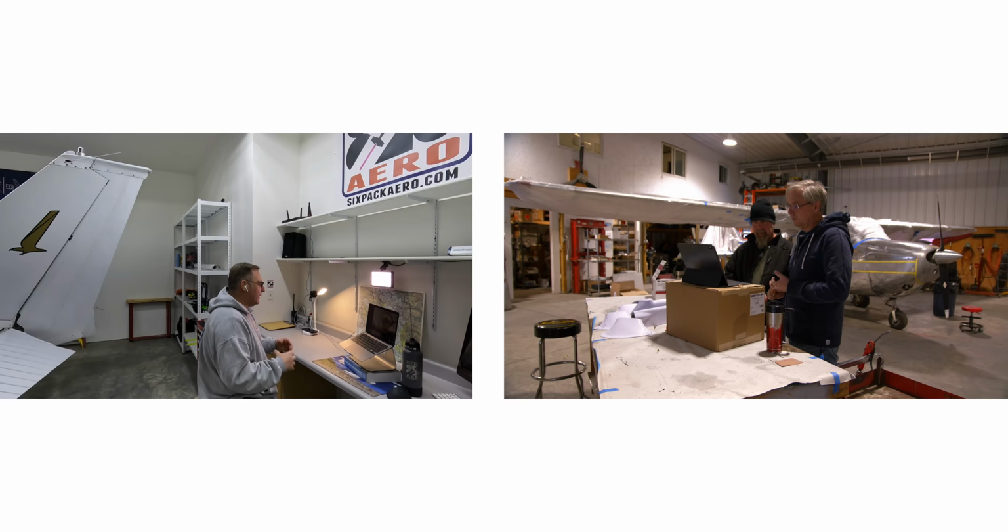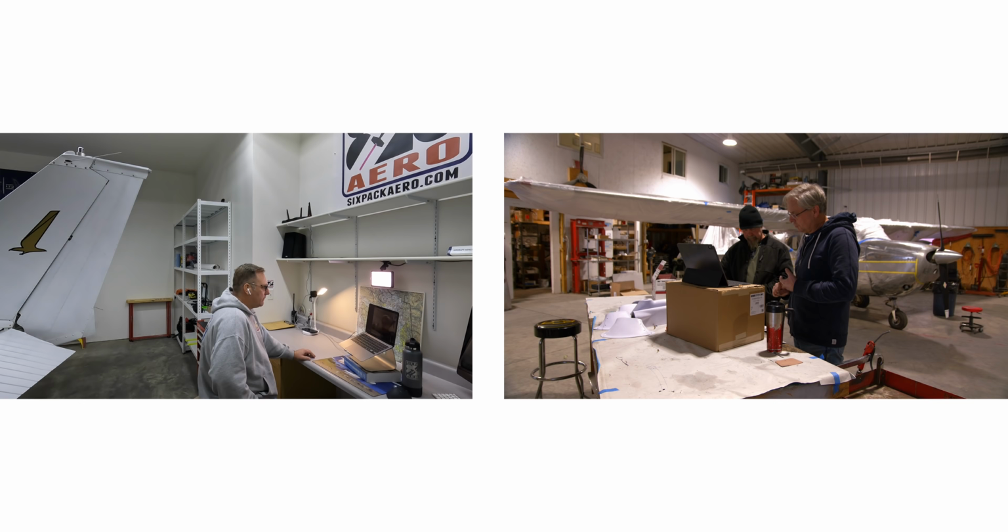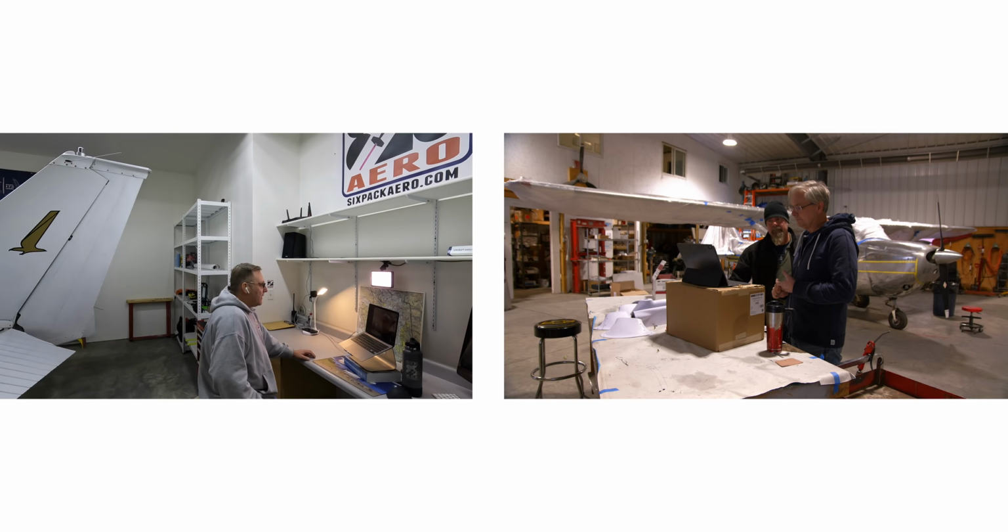Excellent. You will also etch on our registration mark, correct? I didn't put that on the drawing. That's correct. What we do is it's a two-stage process, so we lay down a base white, and then we'll go over it with the top coat, and then we'll go back over it and laser engrave down through that top layer. We'll be producing another drawing that'll probably be sent out later this weekend that'll have all the actual markings. Everything in the drawing so far is just for placement to give an idea, but we go in and create a vector file that'll have everything on there.